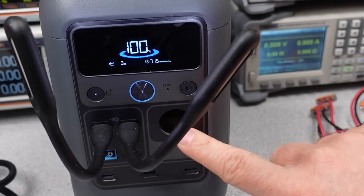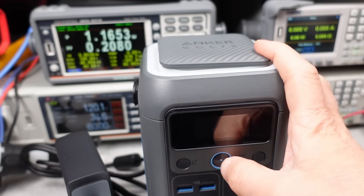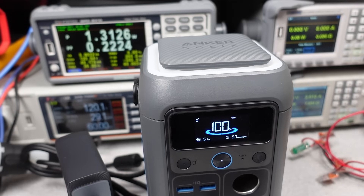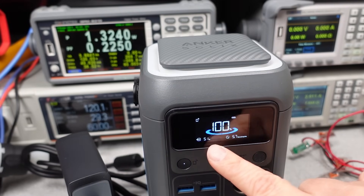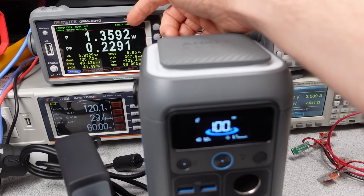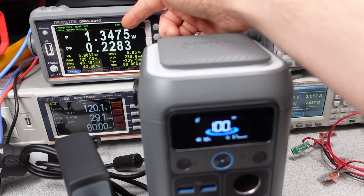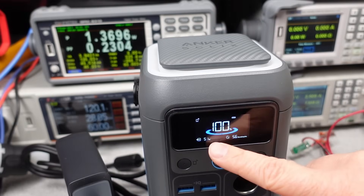So is it a UPS or uninterruptible power supply? No, it is not a UPS. It will not source power from the power adapter directly to the output. All of the energy through the device has to go into the battery, then back out of the battery. So if you keep this plugged in all the time, it will continuously be charging and discharging the battery. The power will stay on, but it's not a good idea and it's not what this is made for.